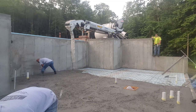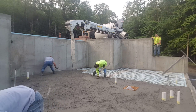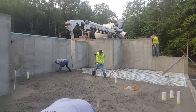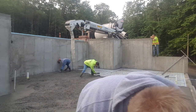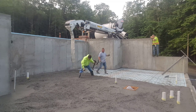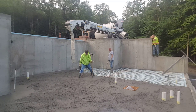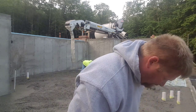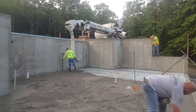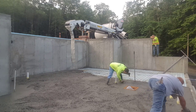That's well worth it to get this floor done quicker. A pump truck would cost us about $900 to do this floor, so there's quite a significant savings over a pump truck. And if we just tried to shoot it or wheelbarrow it, that's just more labor. For $250 it's kind of a no-brainer, especially with just the three of us. I'm shooting my grades now — we wet screed everything. Sometimes we'll use a vibra screed and sometimes we'll just kick screed the old-fashioned way; this one we're just going to kick screed.